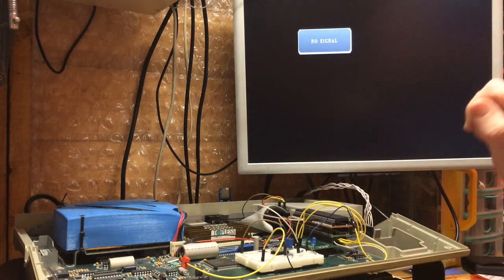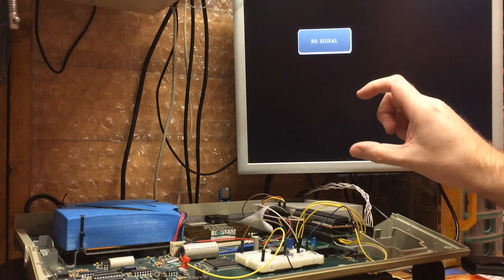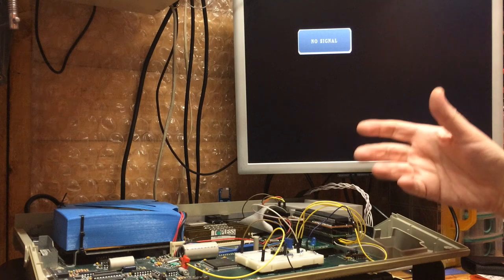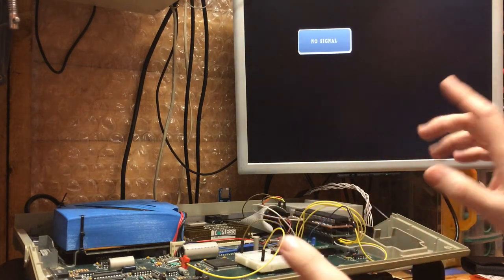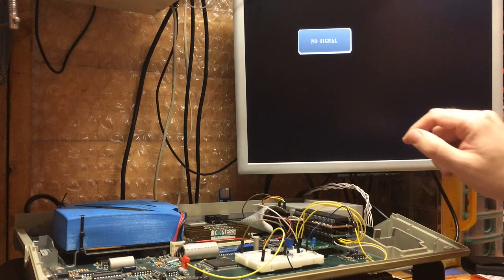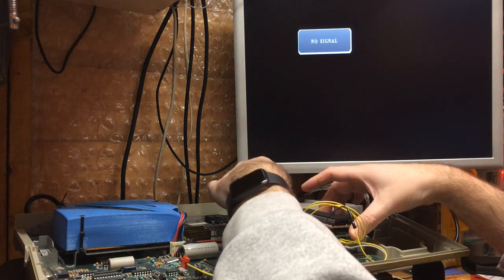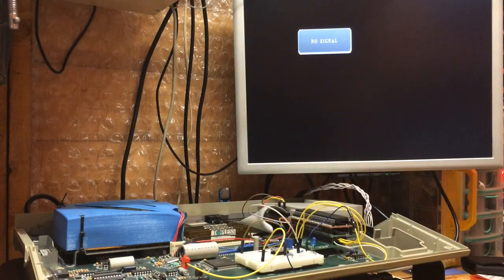I am thinking about doing something slightly different, changing the way that I handle the SD RAM a little bit, and putting a pair of back-to-back latches in there so that I only have to retrieve the data once and hold it in the latch until it's ready. Hopefully that makes things a little bit more efficient firmware-wise. So that's what I'm hoping to do next. This is kind of the end of the line for this one. I thought I'd just give a bit of a demonstration as to where we are.